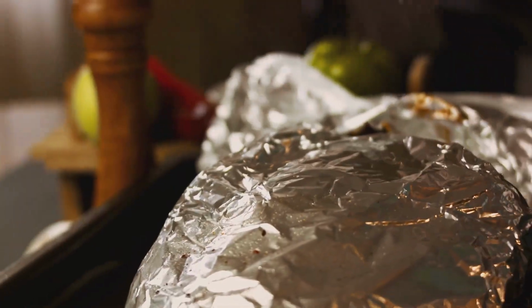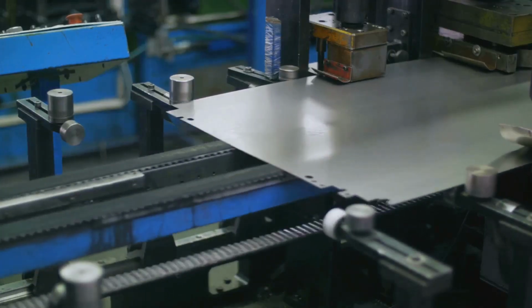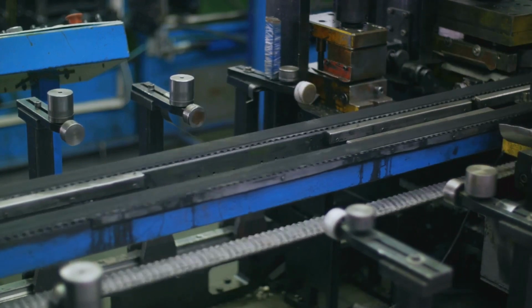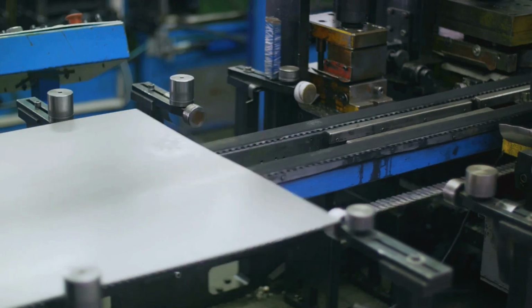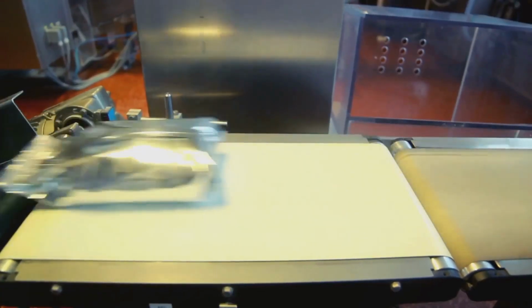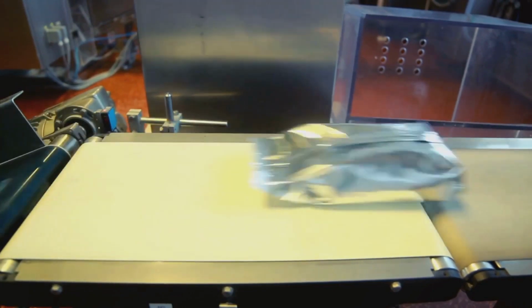It's the same principle. Once heated, the aluminum is then passed through a series of large rollers, sort of like a high-tech pasta machine. These rollers press the aluminum into thin sheets. The more times the sheet is passed through the rollers, the thinner it gets. The aluminum is rolled back and forth until we achieve the desired thinness, but we're not done yet.